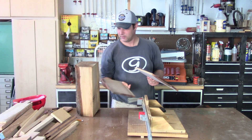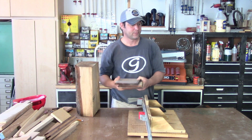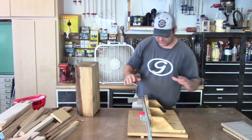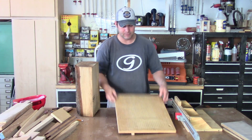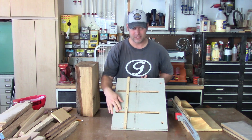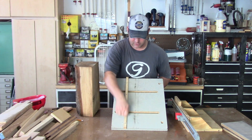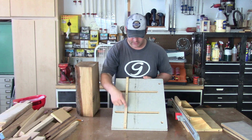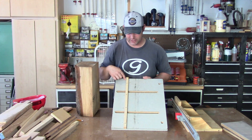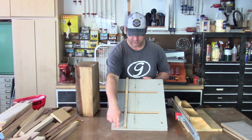This is some walnut that I got — actually it's the same tree that this piece is from — that I got up in Raleigh. So this is the jig that I use. It's kind of simple. This is just a piece of countertop that I have laying around as scrap. I made a runner out of — I think this is hickory — and I screwed that down and made sure it was dead straight to this reference line here.